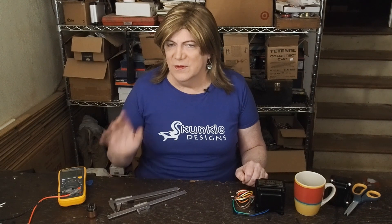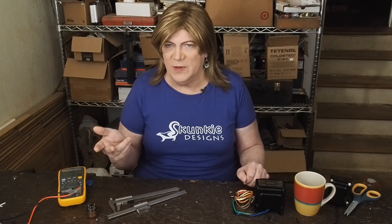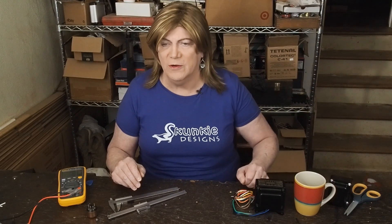Let's talk about the A50 first. On the plus side, direct heated triode — 300B tubes can sound amazing. The 300B tubes the amp comes with don't sound amazing, so you need to replace the 300B tubes, the rectifier, and both of the driver tubes. The 6SL7 China tubes they come with are terrible — they're just horrible.